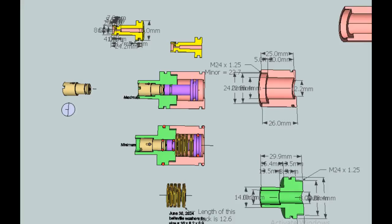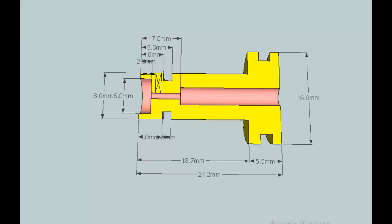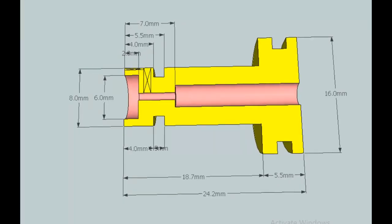Hello, good morning. Today I want to talk about the regulator I'm using — this is homemade. The first part is the piston. If you plan to make your own, you can copy the dimensions shown here. You'll notice there's a 6mm hole that will hold a piece of Delrin that will form the seal. The piston has a diameter of 16mm, because the Belleville washers I'm going to use will correspond with that.